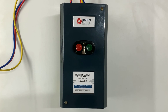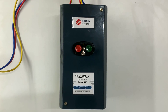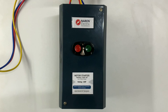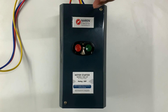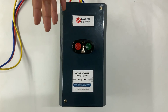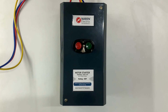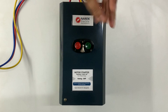Since this is a current-based preventer, the advantage is that even if one of the motor cables gets cut — sometimes at the joints one of the cables can get dislodged — even in that scenario the preventer immediately turns off the motor. So the advantage of using a current-sensing preventer is it takes care of both the supply end as well as the motor side. If the line is cut at the supply end or disconnected at the motor cable end, the motor is turned off, giving you complete safety from single-phasing. Since the starter also has a thermal overload relay, it takes care of overload tripping.